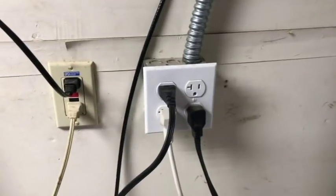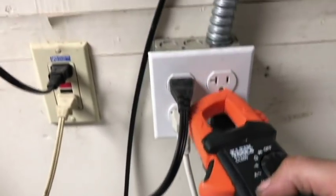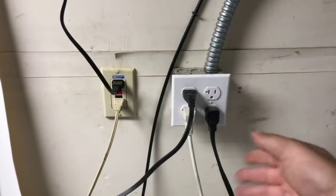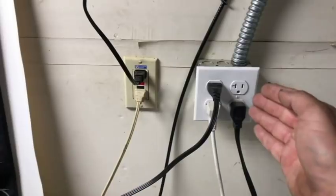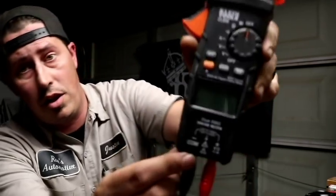If I flip this on to voltage and press and hold the NCV button — I'll show you in a clip — here's your average wall socket. I put this end up to it and press and hold: see that little red light? That tells me this circuit is hot, so I'd need to flip the breaker off before working on it. I also used this meter on my buddy Aaron's pickup truck when we were testing it for a bad PCM. Somebody asked if it's fast enough to gauge voltage at the fuel injector — yeah, I think so. It's a pretty fast multimeter and it's also true RMS.